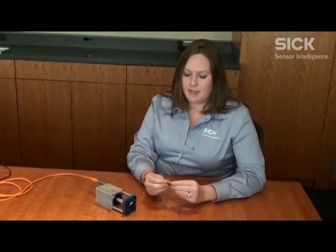Because of our triple sensing range, we're actually able to keep the electronics outside of the pressure zone, which is a huge benefit over most of the competition. They have to have their electronics much closer to the tip, inside the pressure zone of the hydraulic fluid, and therefore it's a much shorter life expectancy. It's very difficult to change sensors on hydraulic cylinders because you have to remove all of the hydraulic fluid, put the sensor in, and replace all the hydraulic fluid. So this is a huge advantage. Remember: up to 500 bar hydraulic cylinders and a much longer life expectancy.